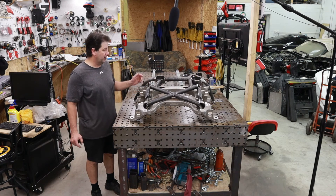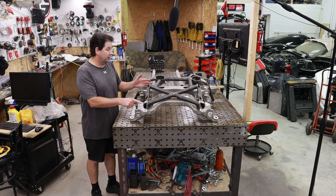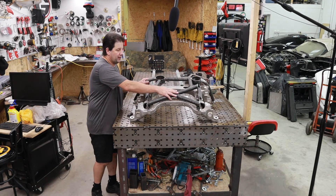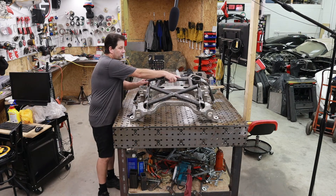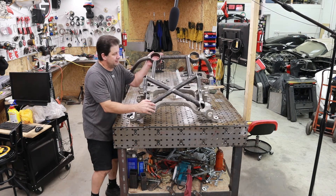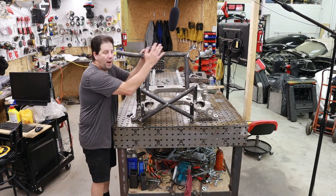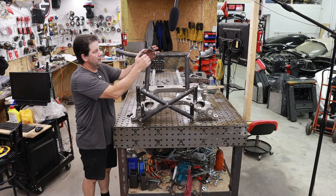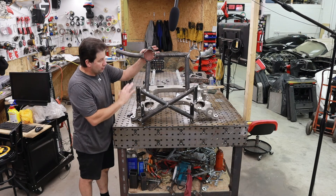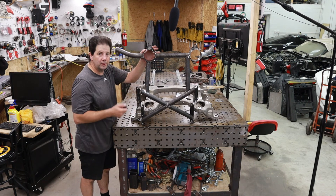I finalized the cradle — here it is, still attached to the jig cradle, which is the uncut one going in the other car. We've got a cross member here replacing the original, and this cross member replaces the other one through these two tubes. These pockets are for the trans mounts — the Mustang motor mounts I'm using. This is going to the powder coater and should be back in a couple of days, and then we'll continue on the build.